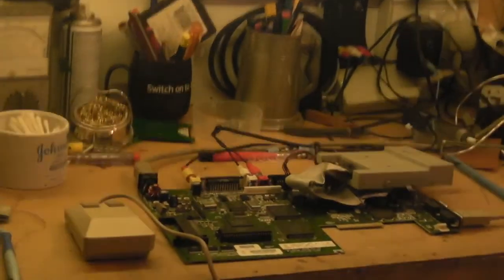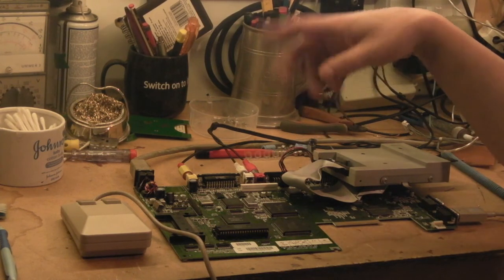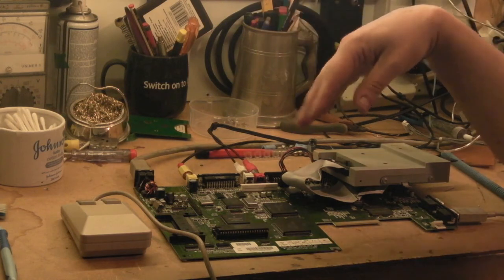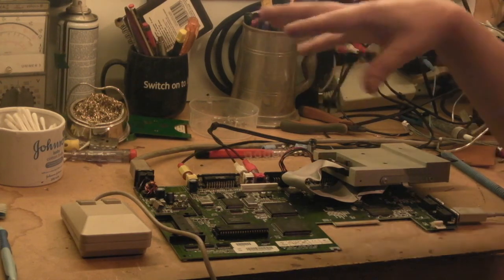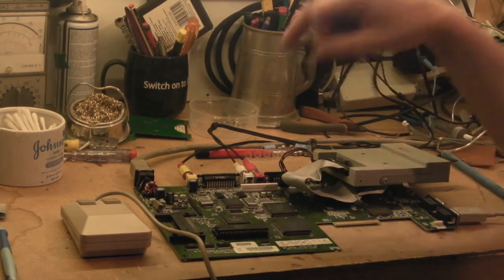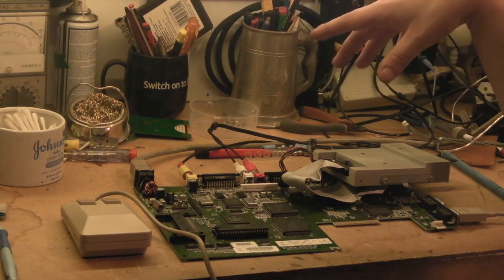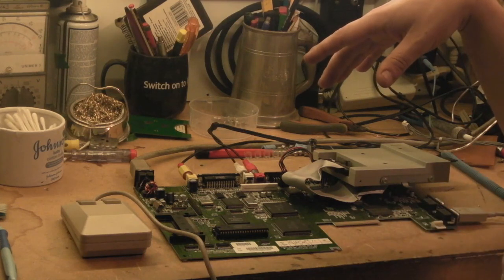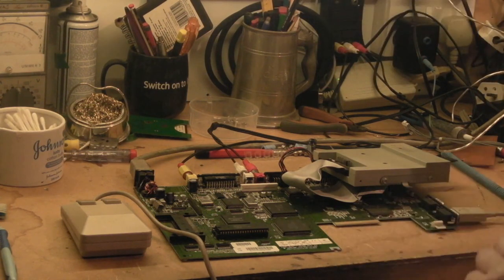So that was three whole parts just to change the capacitors on this Amiga 600 board, but to do it properly. We haven't just glued some through-hole ones on top and called that repaired. We have actually gone through it properly. We've removed the old capacitors, we've cleaned the board up, we've tried to get rid of as much of the old electrolyte as we possibly can. We've cleaned up any damage that's already been done to the board around the chip legs, things like that. Put nice new capacitors on there, and as you can see, we do still have a nice working 600. So like I said, we'll do the disk mod in the next video, and then the video after that I think we'll look at putting this thing all back together. Hopefully my RAM expansion will have arrived by that point. We can put the case all back together properly, do the hard drive, do the RAM expansion, and we should have quite a nice little working Amiga 600 at the end of it.